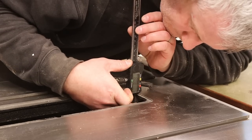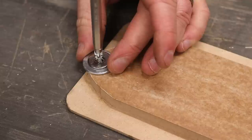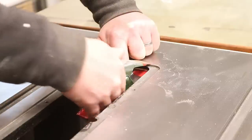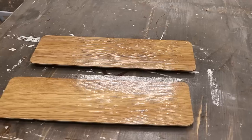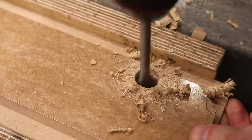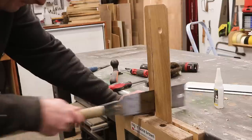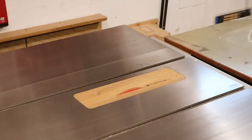Just when I thought I was almost there I realised there was another sticky-outy bit — honestly, these tool manufacturers don't make it easy for us. I then measured the thickness of the table at the back — about 8mm — and wanted to add something to hook under the underside of the table to keep the plate secure, so I used a couple of large washers. Since my insert plates are 12mm thick and the table is only 8mm, I added a little shim to the inside of the table with super glue so in future I can make all my insert plates using 12mm material. I added a couple of coats of spray varnish, drilled an 18mm finger hole so I can take the plate out easily, and then cut the kerf slot. I extended the slot to allow it to fit over my riving knife using my Japanese pull saw — and that's the tool-less insert plate done.